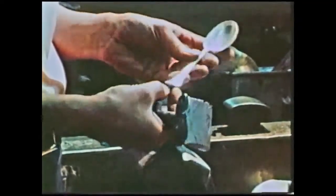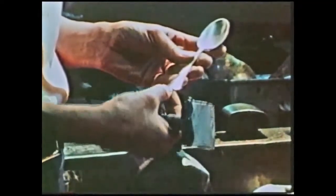Now this is a steel block. It's all right damaging the back end because we have to file this in any case. But we must be very careful about the front now because we've got the fire out and we've also got a bevel and a small tip at the top. So therefore we've got to use this lead hammer, which does not damage the silver. Process is done.